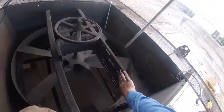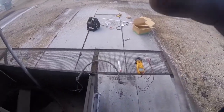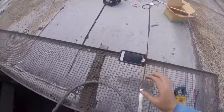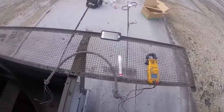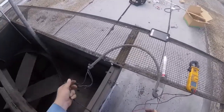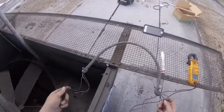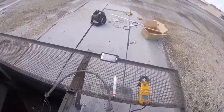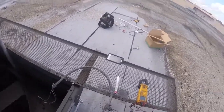I got the new motor and I was toning out the wires. Since it's a three-phase motor, you check it for continuity and make sure your leads are working. I already marked the wires — put one probe on one lead and it beeps, so I mark it with one dot. That's line one. I'll put three connectors on here and crimp them on.